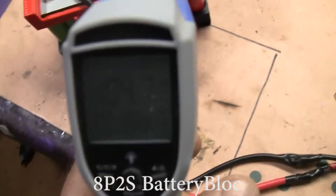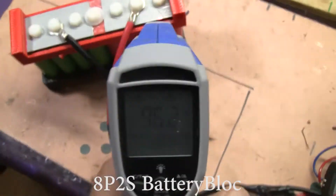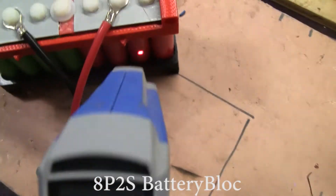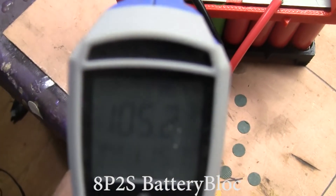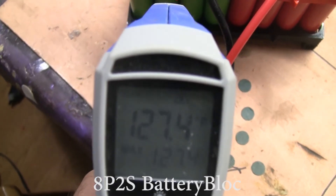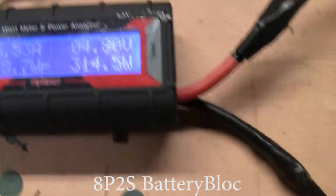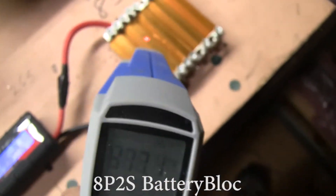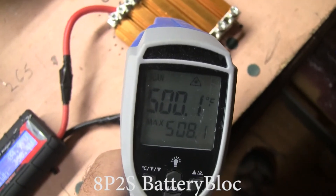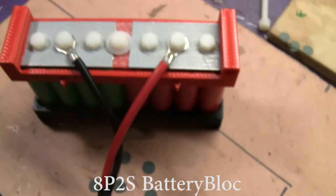Let's check temperatures. The battery block is about 95 to 96 degrees — see where I'm shining it, right there. The cells are 104, about 105. The cells down here are hot because they're green cells; they don't have quite the capacity. The cells are heating up the top of the battery block. We're still drawing 65 amps. I can smell these resistors cooking — they're frying the piece of wood underneath because they're over 500 degrees. We are putting out 328 watts from this one little battery.